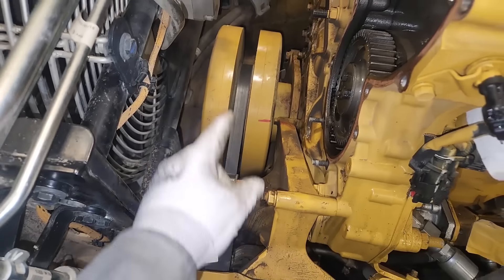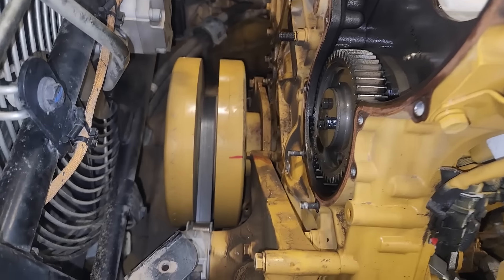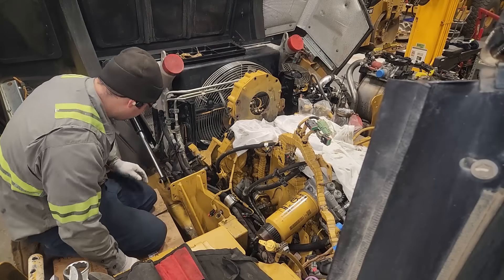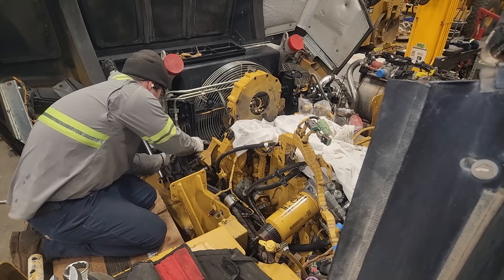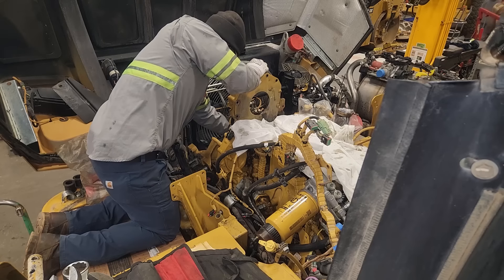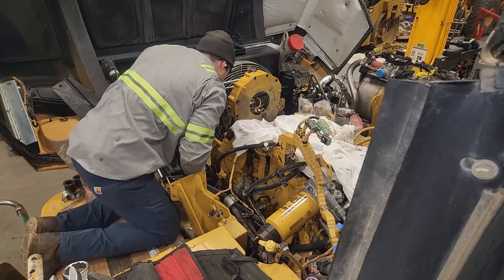In this case, both dampers - these are both huge too. I don't know why this engine has not only two dampers, but they're twice as big as the truck ones. It's something about vibration on this engine. But the good news is - remember what I said, some things are easier, some things are harder. The belt drives on this are very simple. There's just an alternator, one idler, one tensioner, and the AC compressor. They're all kind of tucked away in the lower left part of the engine, so getting the belt off is actually pretty easy. Getting the alternator off is pretty easy. Batteries are disconnected.